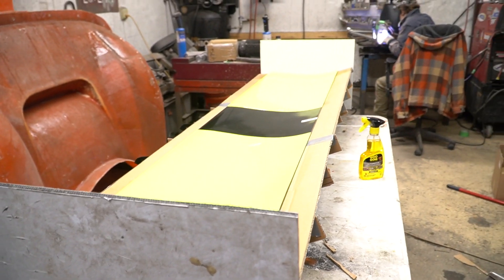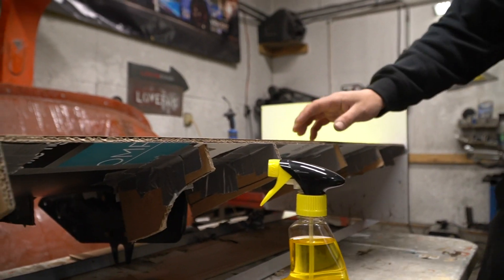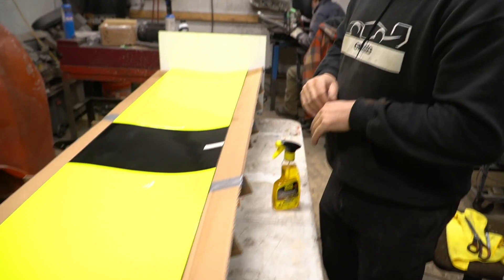Here it is — so we're building a mold on this. Mitchell's been helping me deal with all kinds of stuff today. In my previous wing videos I do a top half and a bottom half wing and glue them together, but I'm going to try to build this mold so the mold halves bolt together with the one-piece carbon wing on the inside. It's going to be interesting to see how I do it with infusion, but I'm going to try it that way because I don't really have time to do all the binding and that. So a couple more hours of laying it up versus two to three days of trying to glue stuff together. Here we are — we're going to get ready to lay some glass.